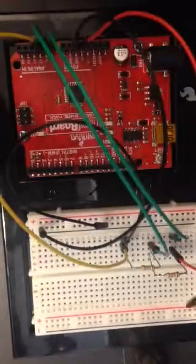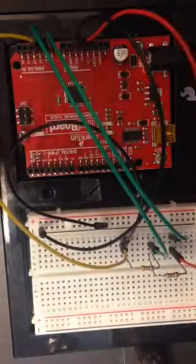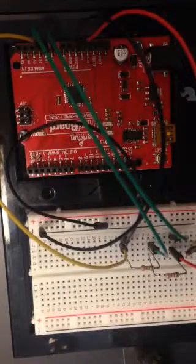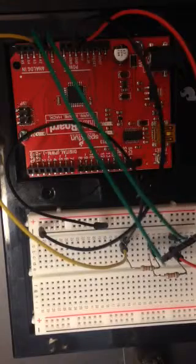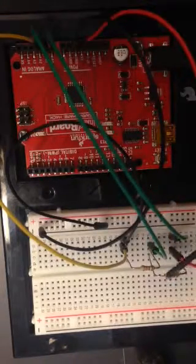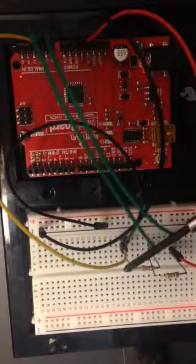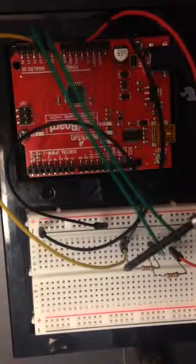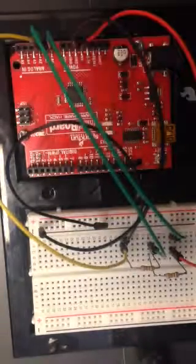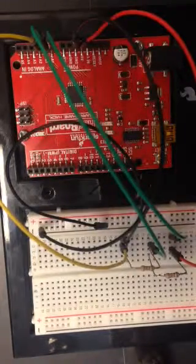So now I expect, let's see if I can get a pointer in here now. Okay, I expect at the top to be at 5 volts all the time, and then I will have some voltage between the 2 resistors, and then I expect to be at ground on the far side of the 2 resistors. So that's how I wire up that part of the circuit.